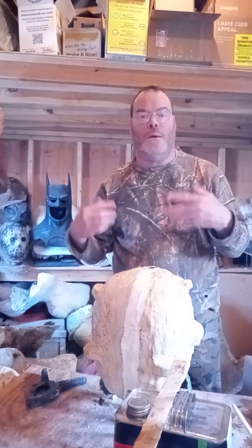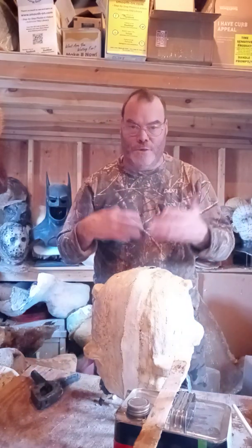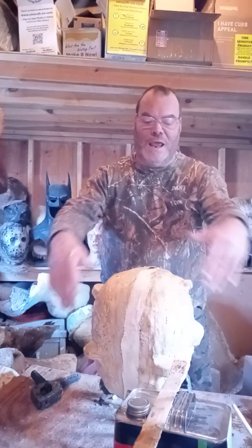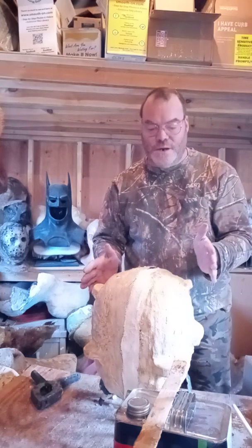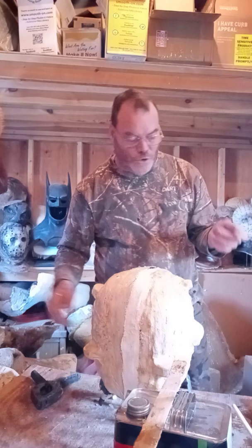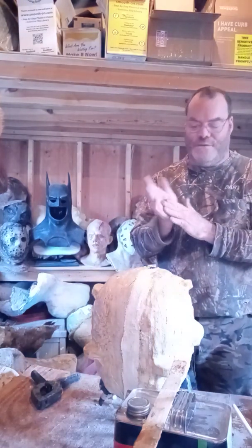Now, in about an hour, I'll come back out, and we'll go from there and do another brush up layer like that. Then we'll cut some chopped fiberglass, soak that in resin, lay that on the inside, do that 2 or 3 times, and then when that completely cures, demold it, we'll have a helmet. Then you just trim it up, do all that stuff, and prime it, paint it, and boom, you have it.